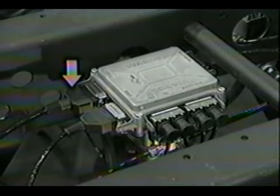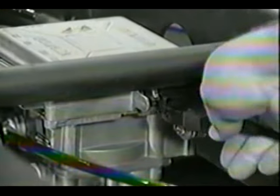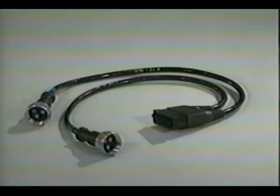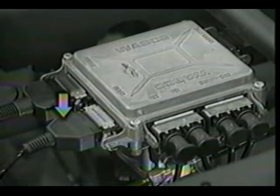Additional components of the Easy Stop ABS include a four-wire power cable, which provides power to the ECU from the trailer wiring harness. This cable also provides a path to ground and a wire for the ABS warning lamp. A three-wire ABS modulator valve cable is required on systems with a standard ECU and an external ABS modulator valve. This cable connects the external modulator valve to the ECU. In a 4300 system with two externally mounted ABS modulator valves, this double-ended Y cable is required to connect both valves to the ECU. The diagnostic cable can be used with the standard and 4300 systems.